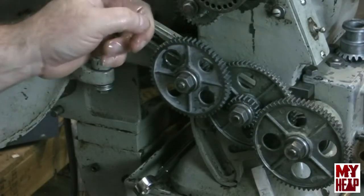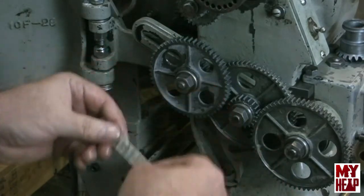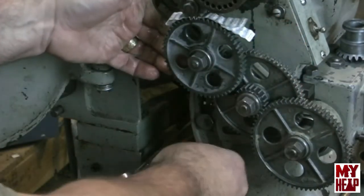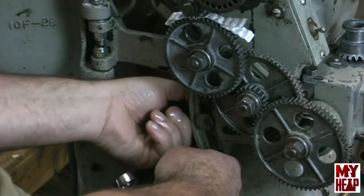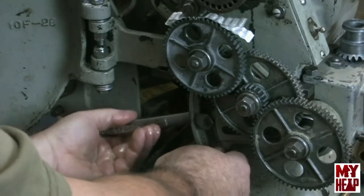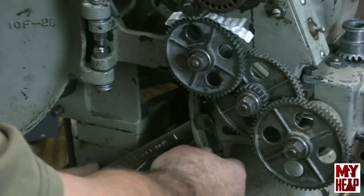Next, the 56-tooth gear will mesh with the 16-tooth gear on the spindle stud. I take the typing paper and mash it between those gears while holding pressure from below. Back behind the banjo, the nut tightens against the washer to lock it against the banjo casting. Getting a wrench in there is kind of a pain — I think I'll find a cheap wrench and cut it down to fit. Once it's snugged up, I can turn the spindle and confirm I have the right play.